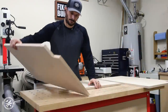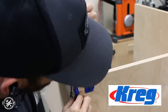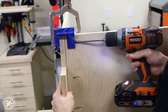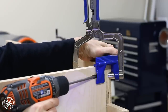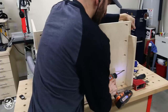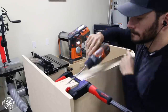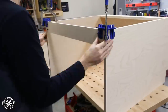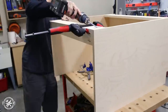To help hold the parts together I'm using the new corner clamps from Kreg, the sponsor of today's video. The clamps hold the parts square and have a little recess that fits right over the pocket hole, so you can hold everything tight and still drive in the screw without needing to move the clamp. I'll have a link in the description along with downloadable plans to make your own cabinets. These top supports will hold and secure the worktop to the cabinets later, and the back supports will be used to attach them to the wall.